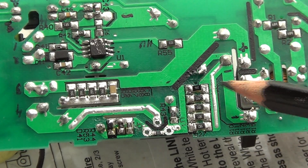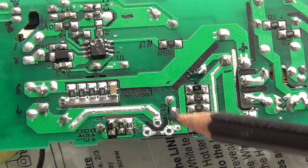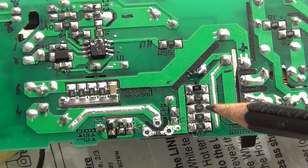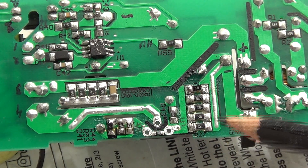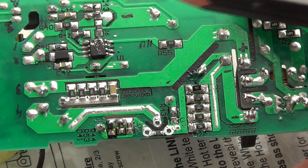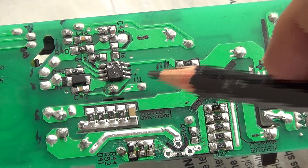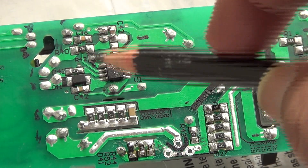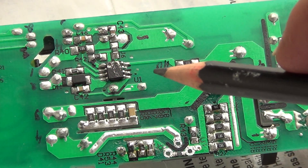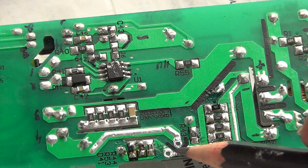The source resistors here are all open circuit, and that is the source of the switching MOSFET. It is highly unlikely that all of these resistors would be open circuit at the same time. So I have to look for more problems, because it is possible that the current sensing is not functioning. I have to trace that and look at some capacitors and resistors on that line.